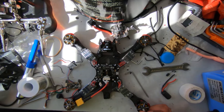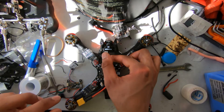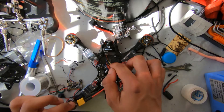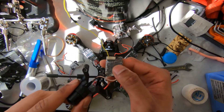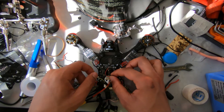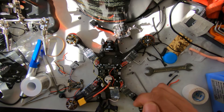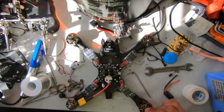Real quick — this is the output coming from the camera. We're gonna solder it onto the right side of the PDB, and this is the video transmitter, which is gonna be somewhere here too. We're gonna have to solder it on here, so I'm going to put everything down from the bottom so it looks much nicer and makes for a cleaner build.